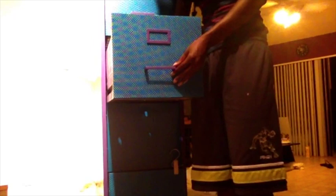Now it's time to reattach the metal frame that holds the label for each drawer. All we're going to do is insert it through the plastic and the metal drawer, then lock it in place by bending the pieces of metal that protrude through the drawer. Make sure you snap it all the way through on both sides nice and secure, then bend the piece of metal on the inside into place. One other step I took to secure the light panel to the front of the drawer was to use liquid nails — that's an adhesive you can find at Home Depot or any other supply store.